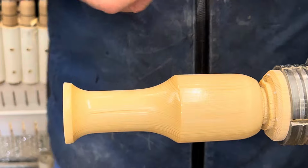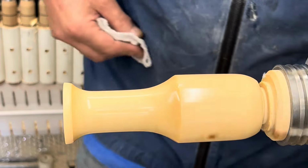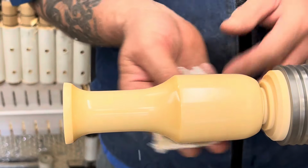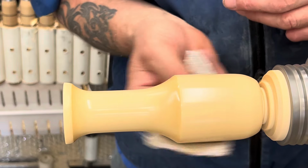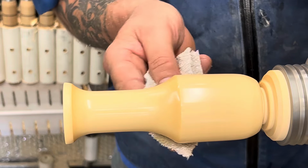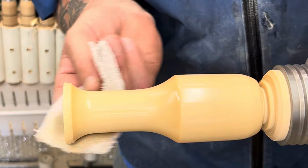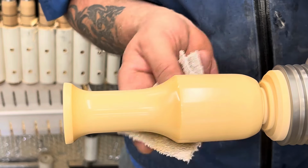Now, if you use French polishing, you would literally just keep going and going with it and building a shine up. But because we've got the lathe, we just start up, and at that speed, we keep going until the oil's basically dried on it. A little bit of pressure, you start to feel a little bit of heat, that's perfect. But don't press hard enough that you drag the shellac. You don't want to put any drags in. All we're doing is drying off the oil.